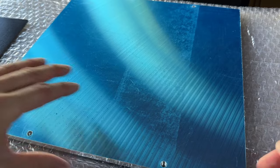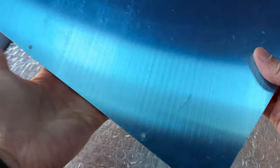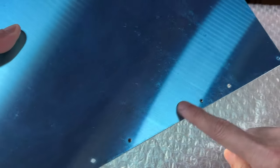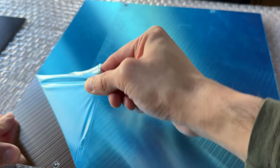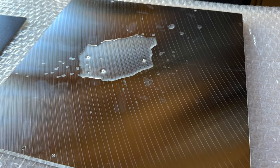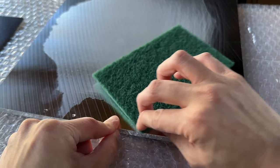Let's just get that build plate in. Quickly check to make sure it is relatively flat with thin manufacturing tolerances. The bottom side has more holes for mounting the fuse and ground wire. Remove the protective covering and clean with isopropyl alcohol. I am using an abrasive scouring pad, so don't remove too much material or you will have high and low spots. I also scuff around the ground screw hole for better contact.